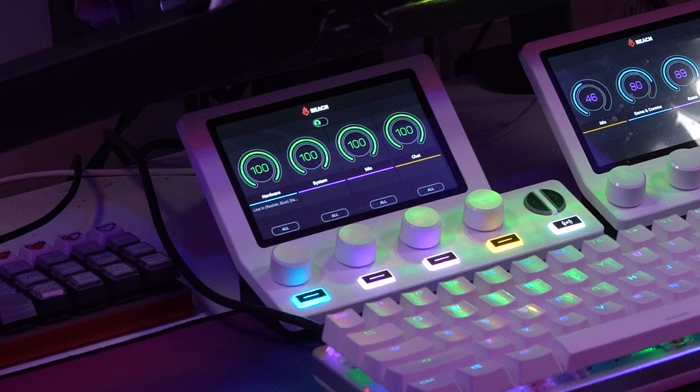So all of that was only the first tab — the mic setup tab — where you're doing your preamp and output gain adjustments. However, they have a couple of other features baked into this microphone that really make it stand apart. First and foremost, you have their noise suppression. There are two different modes: adaptive and snapshot. Adaptive is always listening to your room noise in the background and making micro-adjustments as your environment changes — so if a fan, air conditioner, or refrigerator turns on in the middle of content, adaptive will adapt to those sounds accordingly.